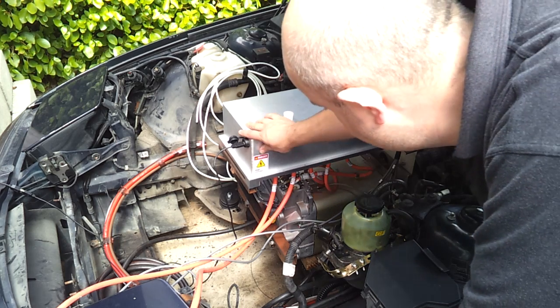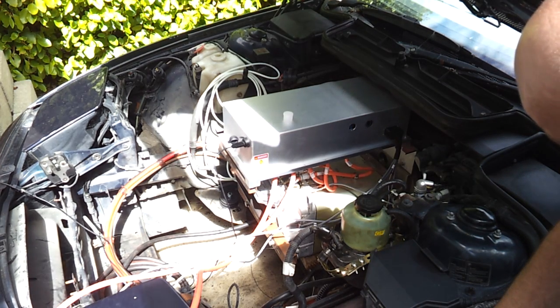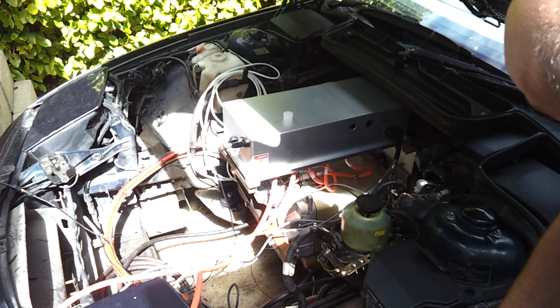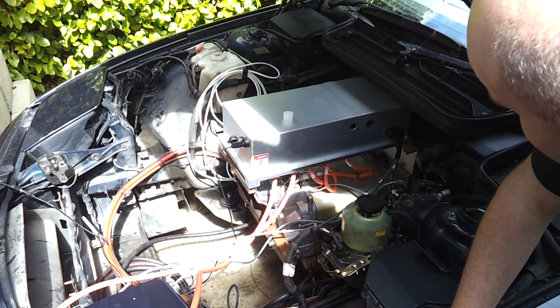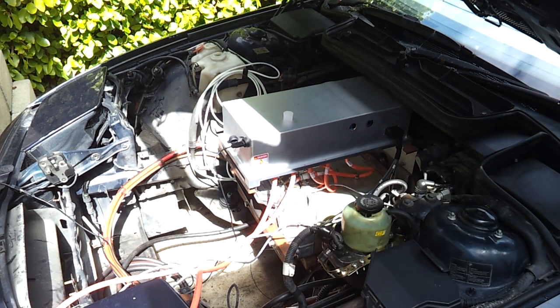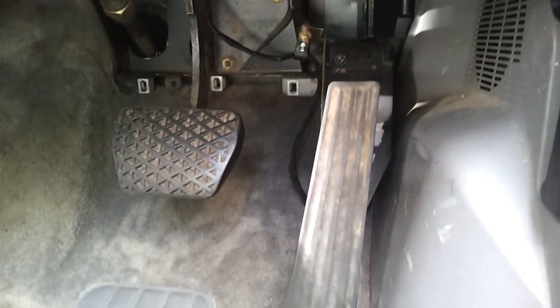We have our inverter installed — it's actually not bolted in, it's just basically sitting on the mounting. I connected up the three-phase wires to the motor; I didn't actually thread two of the cables through to the glands, I just put them in the top because I figured I'd have to take this thing back out. Here you'll see our CEIL 23 connector and our loom. We have three screened cables coming off that loom — one goes to the encoder on the Siemens motor and the other two bring signals so we can send signals to the inverter and so the inverter can actually control things.